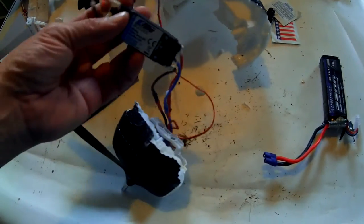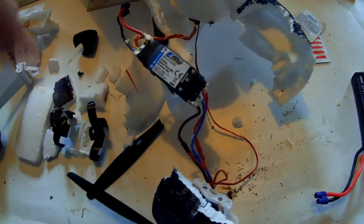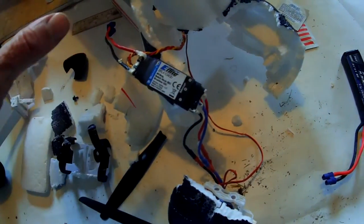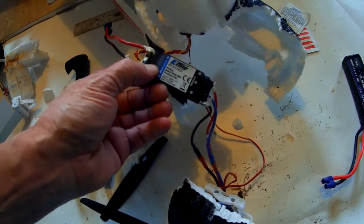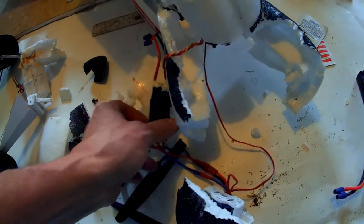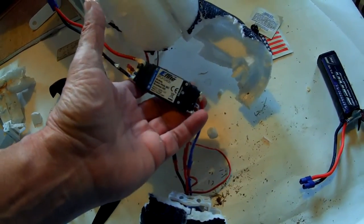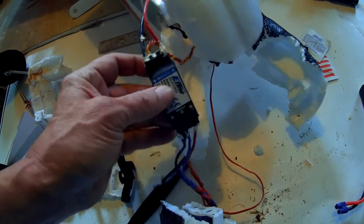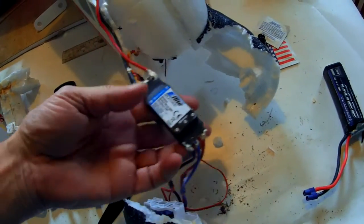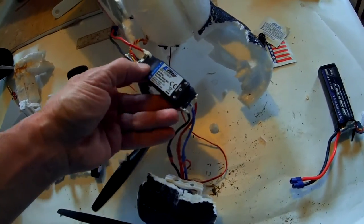It's been mentioned to me a couple of times that other people have had the same issue with the high temperature cutoff on these things. Now mine got hot enough that it actually started smoldering and almost caught on fire. This one just got hot enough that it killed power to everything, and that includes your receiver, so you have no controls on the thing. Because this one did come back and fires up again, I'm going to take the silicone out of here and make sure it's got adequate ventilation when I'm done with the repair, and chances are he's not going to have another problem with this again,